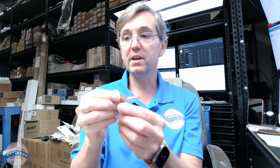Now, you saw how long it took me to cut this one key. I'm now going to take my duplicator and duplicate the keys. It takes a long time to originate keys on a Blitz machine because you are literally dialing the space and then the depth, and you're doing that for every chamber. I've got to cut 56 keys. It would take a long time to cut them on the Blitz machine.